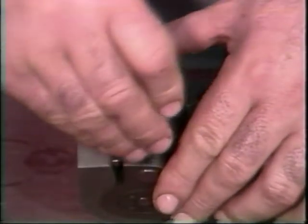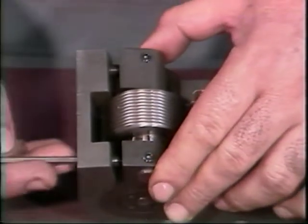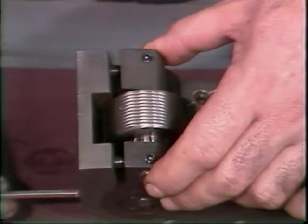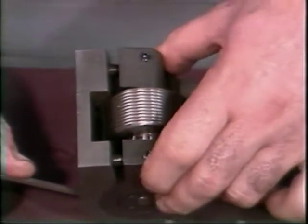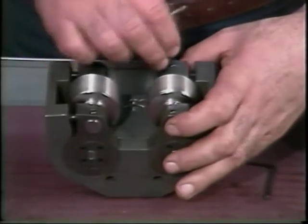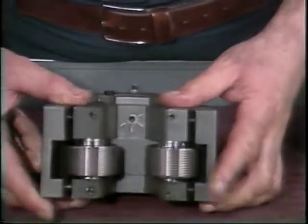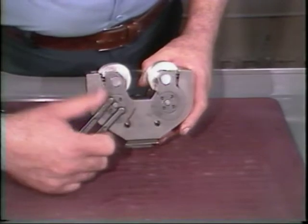The solid arms can now be positioned. Loosen the set screws on the roll pin and move the solid arm until the roll pin will slide freely. This aligns the two arms. Now turn the solid arm adjusting screw down until it contacts the arm, then tighten the locking screw. The same procedure is used on the other arm. The set screw is again tightened on the flat surface of the roller pin.